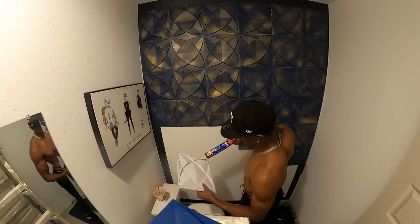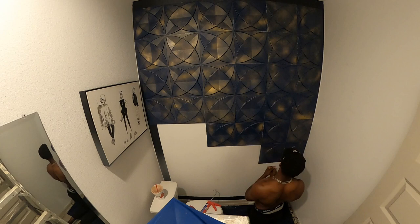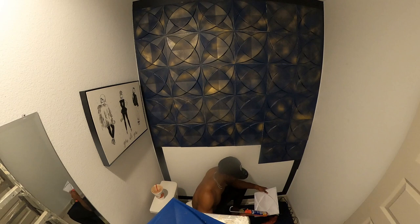Just a reminder while you're doing this: make sure before you even start, you measure out your space and know how many panels you do need, so you don't buy too many or too few. I think it took 48 panels on this wall right here — so it's 48 panels that I'm putting here. Make sure everything is already accounted for. I love doing a DIY project, just getting it going.